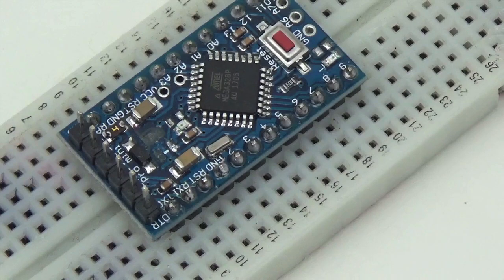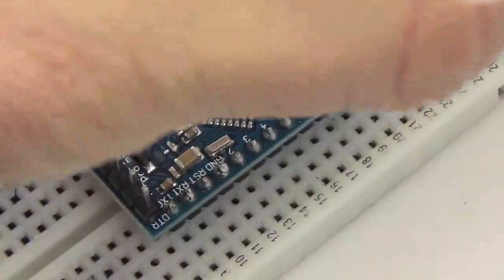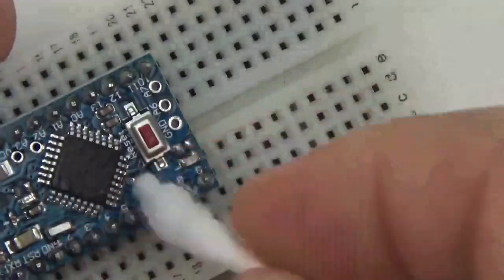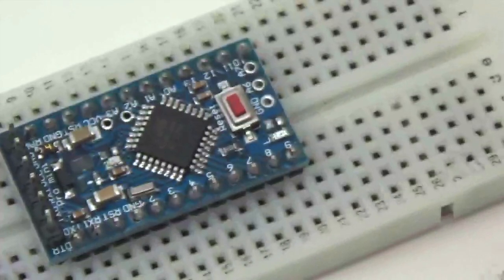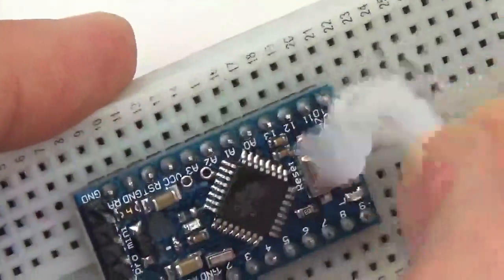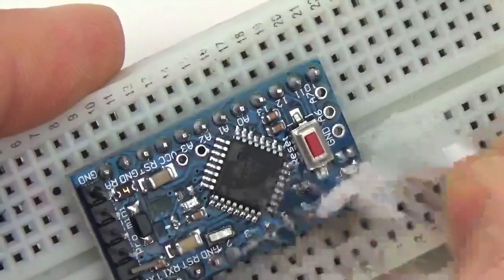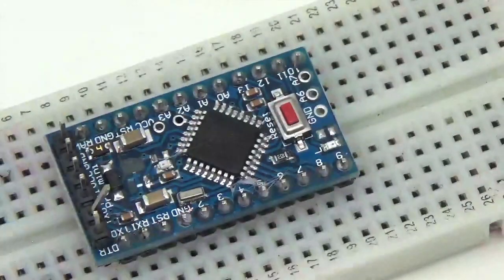Okay, and you always need to clean them after doing some soldering. So just takes a moment here. Once you start doing a lot of these things, investing in a jewelry cleaner, just a cheap one from the drugstore or Walmart or wherever, can save you from having to do this step again in a group work situation where you're trying to get a lot of people processed quickly. It's probably worth the effort to go find a $15 cheapy ultrasonic jewelry cleaner to do this cleaning. All of these circuits are basically, as long as they're not powered, they don't really mind getting wet.